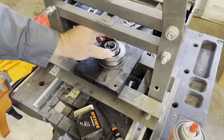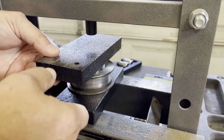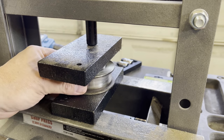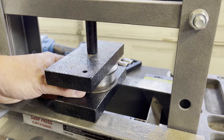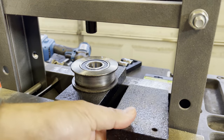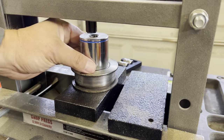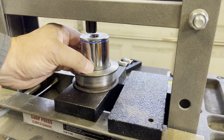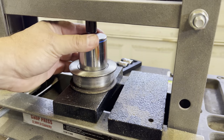Looks pretty cut and dry how we're going to put that in. First thing we're going to do is set this bearing and then put the plate on top of it. This won't push it all the way down but it will get the bearing into place, so we have enough room to set the socket on top of it. Virtually no pressure at all to do this. What you're going to need is a big socket — it's probably not the perfect tool, but when you're in a small shop, you work with what you got. This socket is big enough that it touches the metal on the outside, which is the really important thing. You don't want to push pressure on the center of the bearing — you want to push it on the outer ring. So all we're going to do is just push this down until we feel a little bit of pressure. That should be enough.